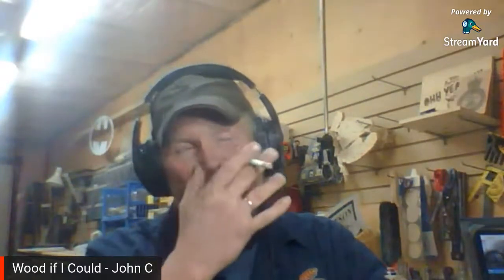Poppy's Woodshed has a question. Do you see the packing tape helps with saving the blade? Yeah, I don't use packing tape. I tried it when I first started out because everybody said, oh, you got to use packing tape, oh, you got to use blue tape, oh, you got to use this. You don't have to. I just used packing tape to help hold the pattern down. Even I don't do that. I basically just use my press and seal, which I've not been doing on this one. But I don't use blue tape. I don't use painter's tape. I don't use clear packing tape. You can put clear packing tape on, but I find that if it's not totally flat as you're cutting through, your sawdust will actually go underneath it, and then you got a bump. And you can't see your pattern at all then.